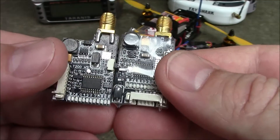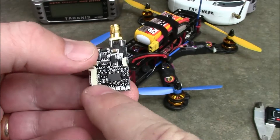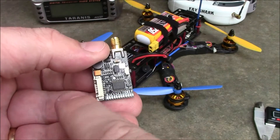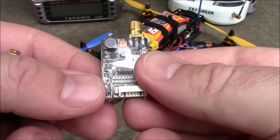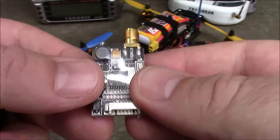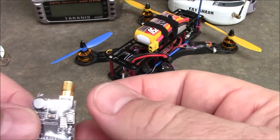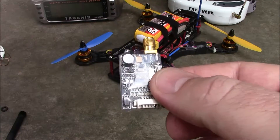The big difference I've noticed — besides the wattage — is that the LT200 has the cables coming out the side, which makes it easier to route back into your quadcopter, whereas the ET600 has them coming out the bottom. It's not that big of a deal because even on this FPV250 where the space is limited, there's still plenty of space to route these cables up to the front of the quadcopter.